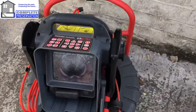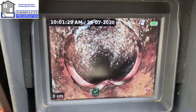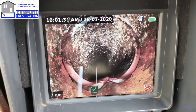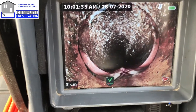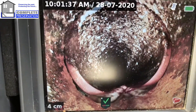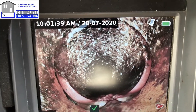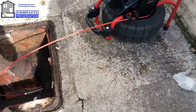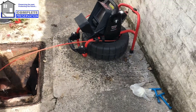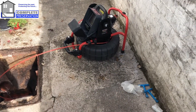I just want to show you this as well — you can actually see you've got a displaced joint now. We've left the tap running so you can actually highlight the water running down the edge there, which basically washes out all the soil around it. There is a bit of a crack in there, and it looks like there's been a repair there previously as well.